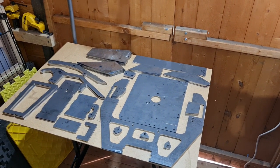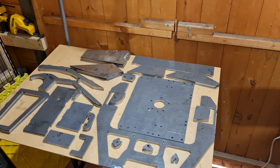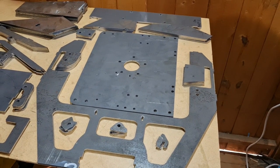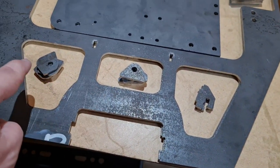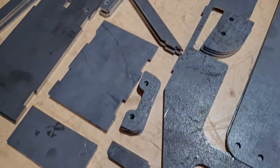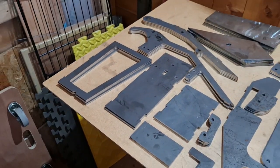Here are all the parts that we've just unboxed. What we've got here are two complete chassis for Slingshot, and also two spare flipper arms as well. We've got the main outer base and the inner base pieces — these ones are from Hardox instead of Titanium, just because it's a little bit cheaper and there was quite a bit of weight to play with. Then we've got the bungee hooks that attach the flipper arm and various mounting tabs. These bits go in the back corners, we've got some parts of the top armour, rear panels which already have all the slots cut in, then the sides, a few more mounting tabs. All these bits sort of go onto the flipper arm, with some more mounting tabs. The top panels, and then some of these little pieces down here weld onto these so that we can fit the carbon fibre tops.